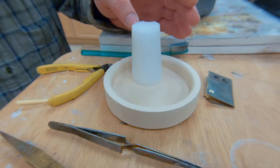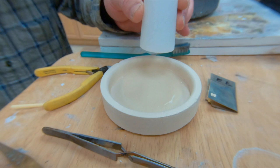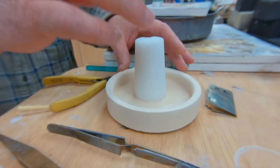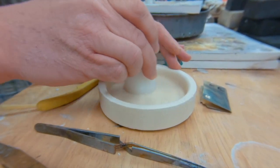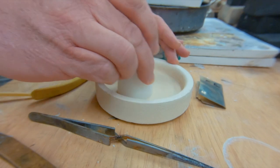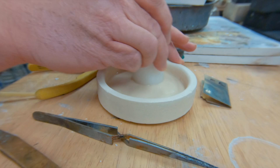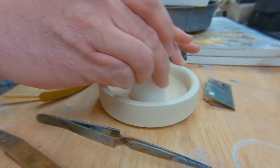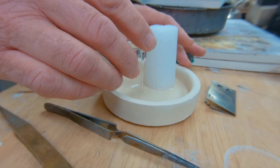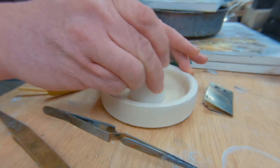The way that you work with this is you're going to add water — I like using distilled water. Tap water sometimes can cause problems in soldering. And then you're going to rub your borax bar on the bottom of the dish. You're going to notice that the dish and the bar will soak up a lot of water. You'll have to add water every now and then, and what you're wanting to do is create a nice slurry of borax.